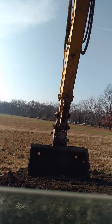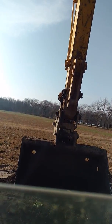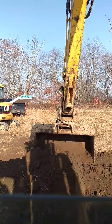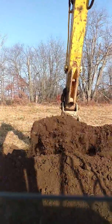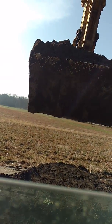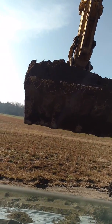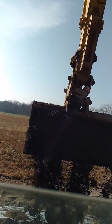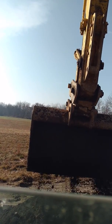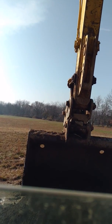What we're doing is spreading this out to about six to eight inches thick, and I kind of pat it down with the bucket — makes it look a little better. This is on a mound septic system. Typically what we do is I'll get a bucket and you always start right here on the center — this is kind of the most important part right here. You definitely want to get at least eight to ten inches on right here. I always take the bucket and just kind of pat down on it.